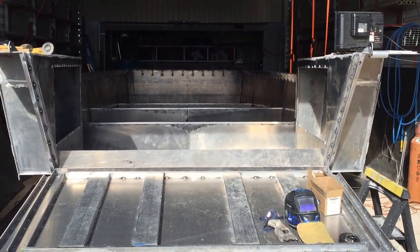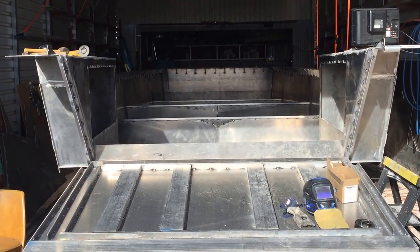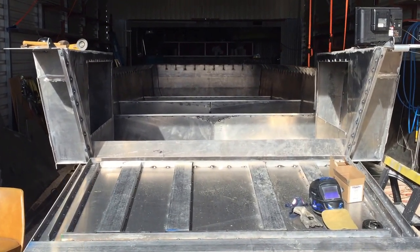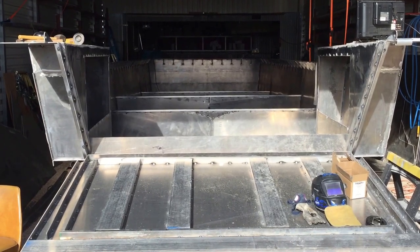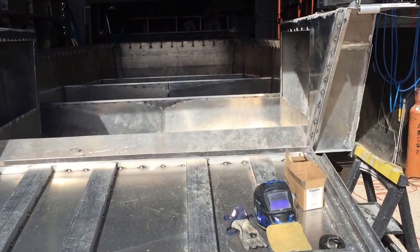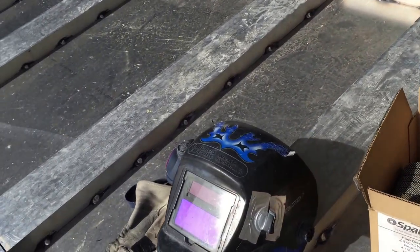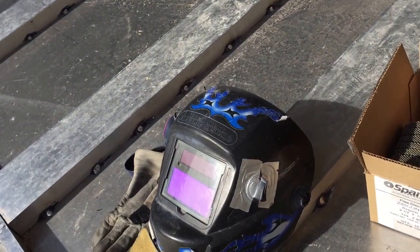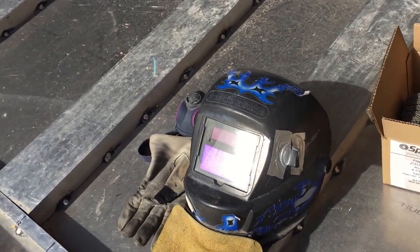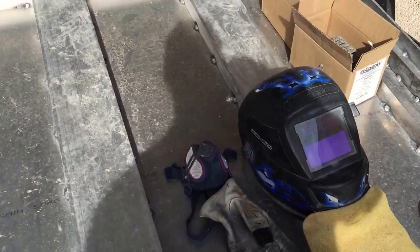This is video number 11 — the third time I've done this video, just kept making a couple mistakes. I talked about this helmet: just a cheap Harbor Freight helmet, it's adjustable, I taped it so it doesn't move anymore. I leave it on number nine — you need to be able to see what you're welding. I wouldn't suggest going any lower than nine or you'll hurt your eyes.